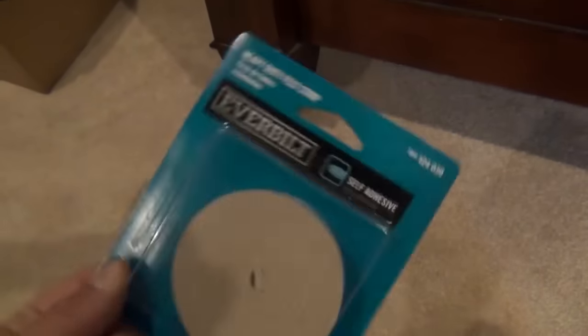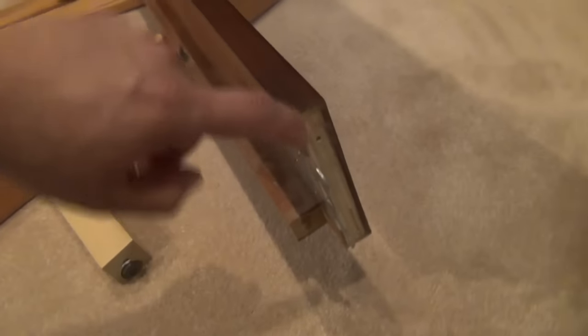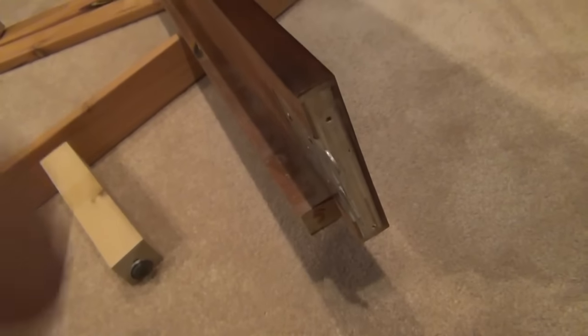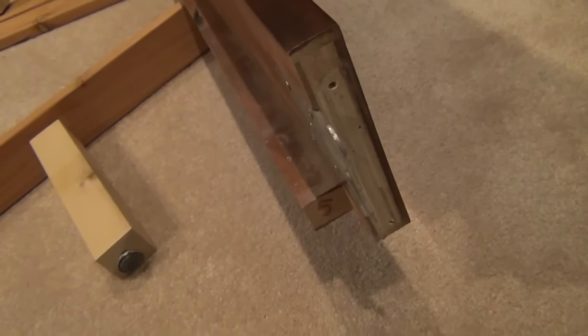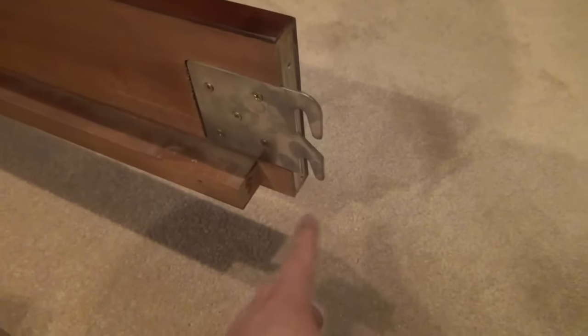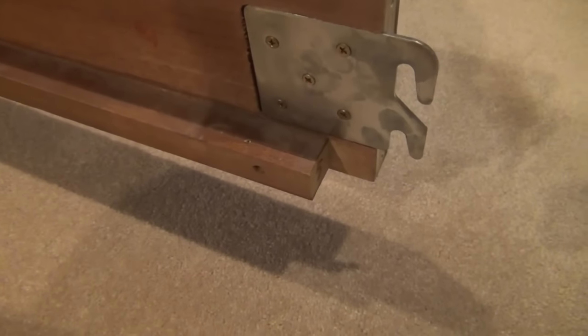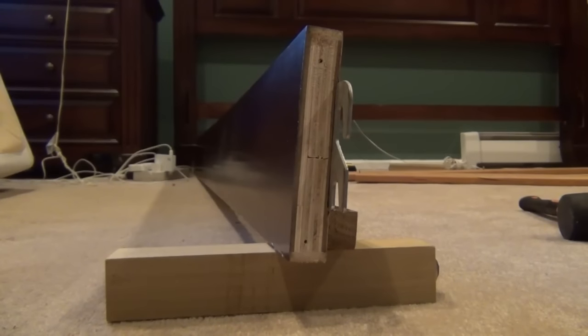This is a roll of felt pad material. What I'm going to do is cut a few strips of this and attach it to the edge of the stretcher rail — that'll take up the gap, and another function is it'll stop the wood-on-wood contact which is where I think the noise is coming from. The noise might also be coming from the bracket where it hooks into the bracket on the post, so I'm going to lubricate those as well with some spray lubricant.